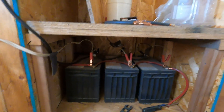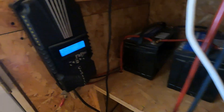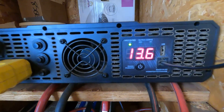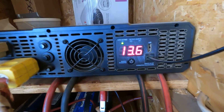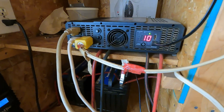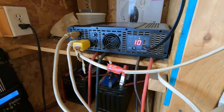It takes a lot of research and asking questions to make it all work. So — 13 batteries, charge controller reads 13.7 volts, inverter reads about the same. There's nothing on in the house right now other than my Wi-Fi, which takes about 10 watts. So powering the system — I have Wi-Fi, a water pump, a full-size fridge that defrosts, and we'll be doing a tour of the house soon.